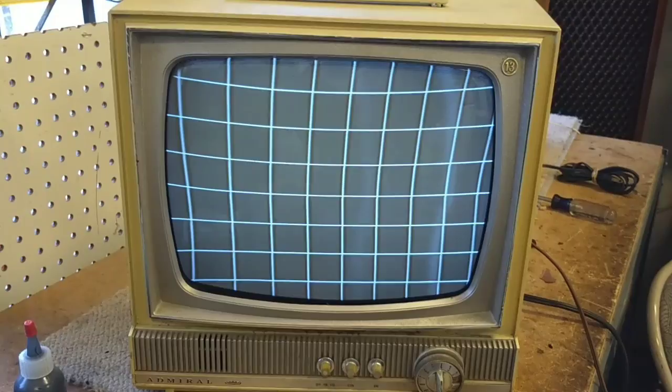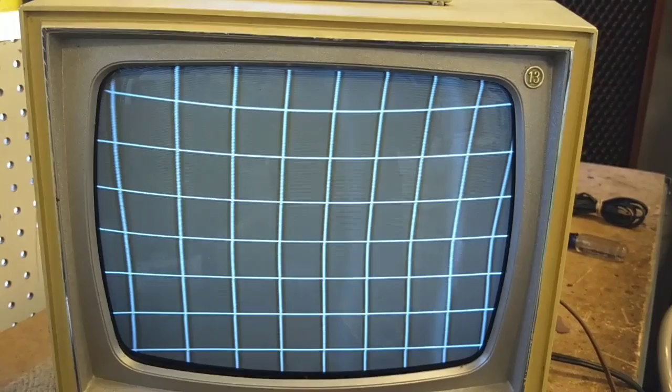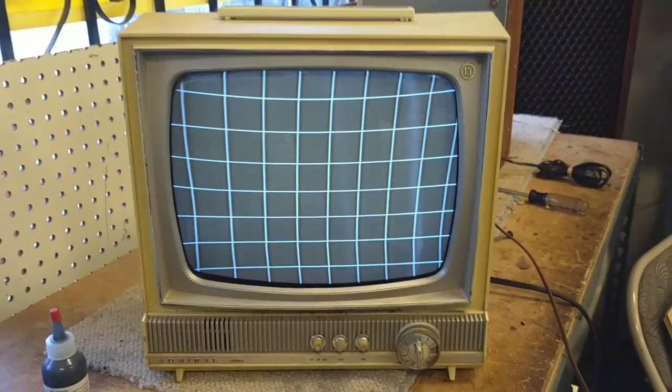There's a little bit of distortion, but for the most part that's watchable. And then we go back to a regular broadcast screen, it should be okay. But here's what I did: I cut down those ferrous pieces and I glued them to the pin cushion magnets after I found out which direction and polarity of the magnet worked the best. I got a combination of lengths by playing with it to correct the pin cushion distortion, the trapezoidal distortion for the most part.